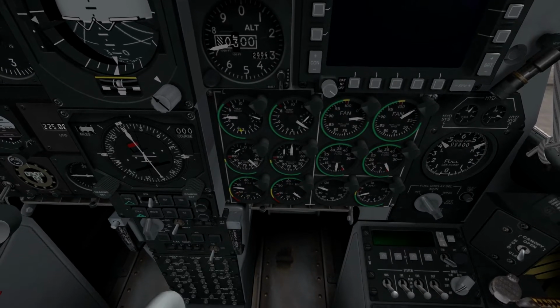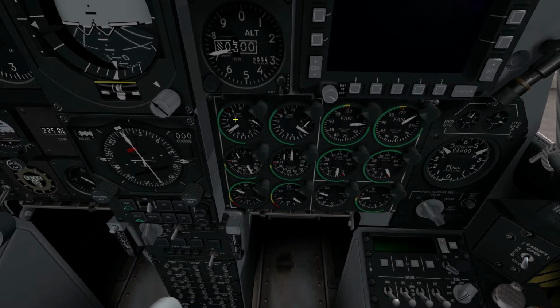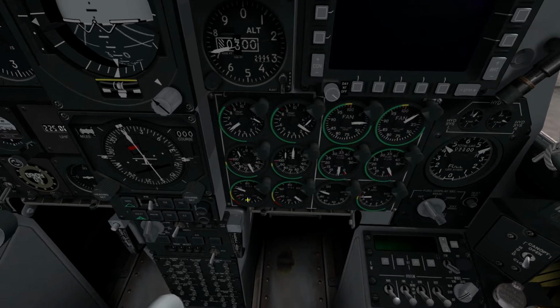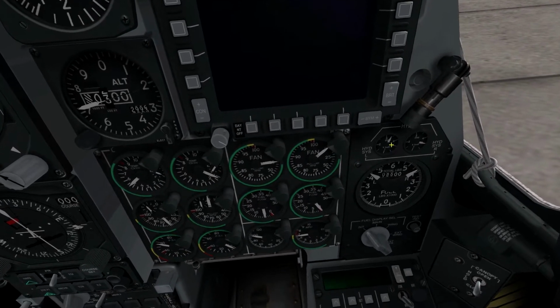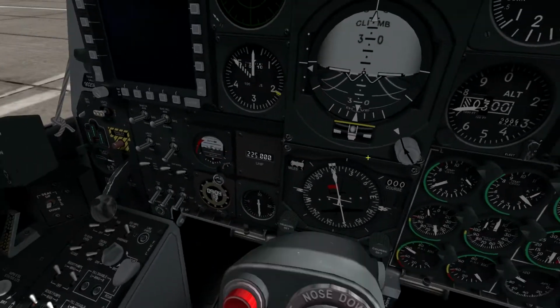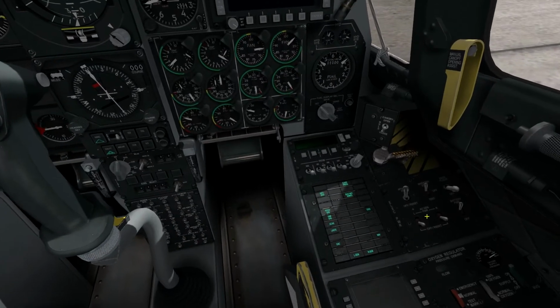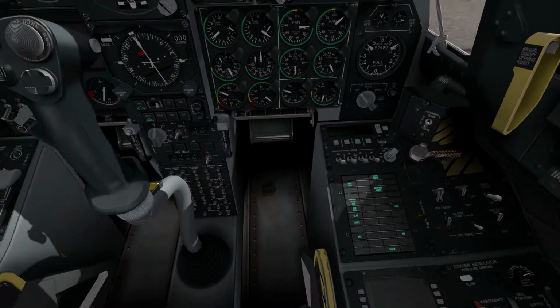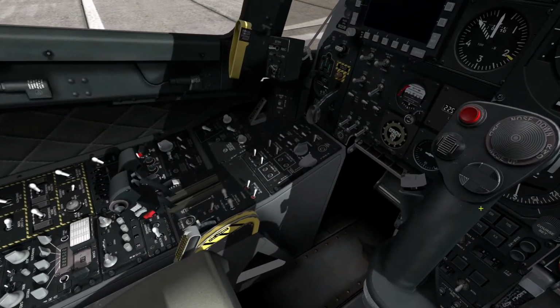We're already in the green. We're about to ignite there about 700 Celsius. And there we go. Engine is started, and everything's in the green. All good. Our hydraulic pressure on the left is good at about 3,400 psi. We'll go ahead and turn on the left generator, and now we can go ahead and turn off the APU generator. The APU generator, that is.